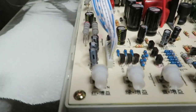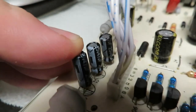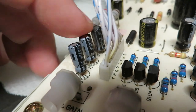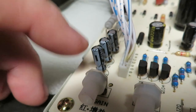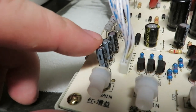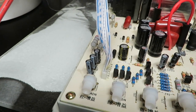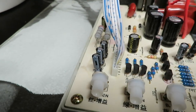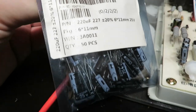I want to show you what happens with the actual screen. Before, as the colors passed they would change — you can see this especially on the green and blue bars. But it doesn't happen anymore with the red now that the AC coupling cap is shorted. I think this is what's happening — I'm going to replace those capacitors with larger values. The originals are 47 microfarad 25 volts — I'm going to replace them with 220 microfarad 25 volts and see if that makes a difference.